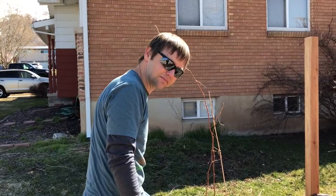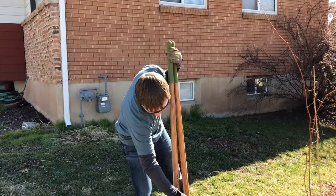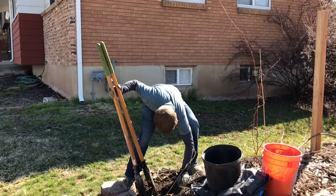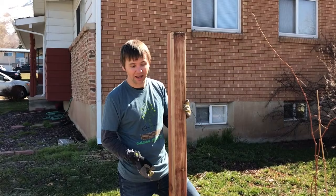Let's show you how we start digging the hole. I've already measured out the spot. You just take a post hole digger — now is really the best time to do it because it's mid-March and here in Utah the soil is still nice and soft. I like to use some plastic to put the soil on so it doesn't make a mess, much easier to clean up. We got our hole dug, about 31 inches, and we left a little extra room because we're going to put some gravel in the bottom.